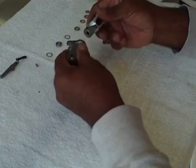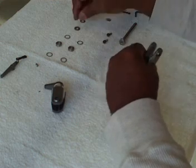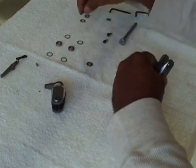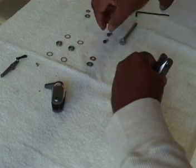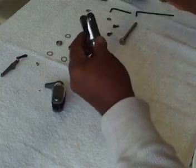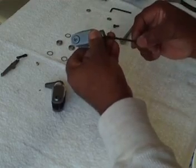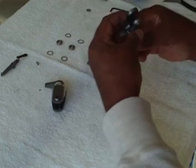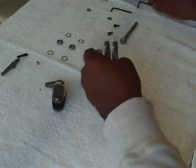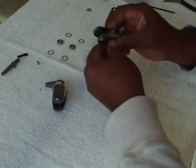So I had to take that apart, and what I found out when I assembled my thrust bearing, which you have here, you have your inner race, the bearing itself, and then your outer race. What was happening when that shaft passed through the first bearing and the second bearing in here, and you put on the thrust bearing, it was actually binding. And I don't know if that's a problem with the machining.